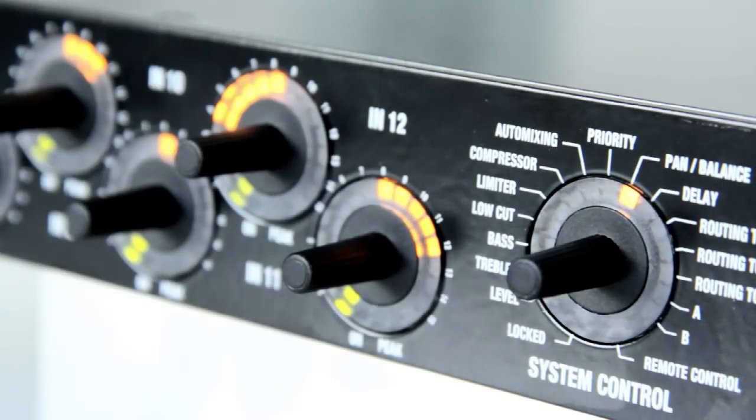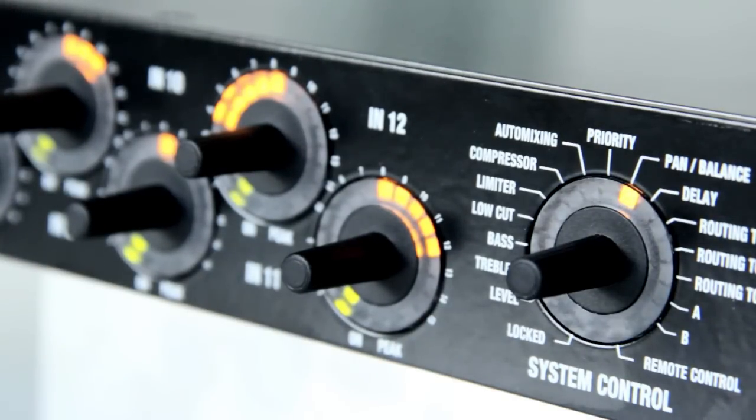One can see into the same direction as the sound comes from. So for all the left guys, let the sound come out of the left speakers. For all the right guys, from the right speakers. That makes it easier to follow a meeting. Or in a feedback-sensitive environment, you can do the opposite. Bring the speaker sound as far as possible from the microphone by routing a person seated on the right side to the left speaker's output and the other way around. That enlarges the distance and will give you more gain before feedback.